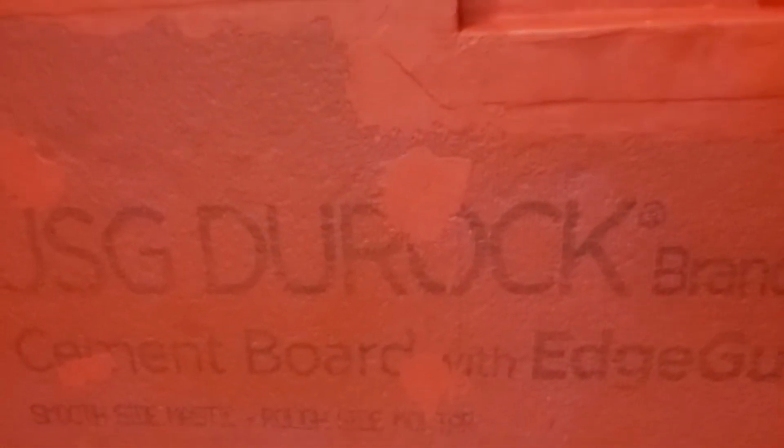Once that's all done, I'm gonna put some light coats on a couple places where it looks a little light still. You can see the concrete backer board was really porous here, and I didn't get that red guard all the way into all those pores. So I'm gonna try and get a little bit more in some of the spots where it looks a little light.